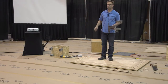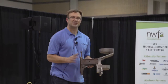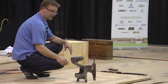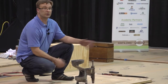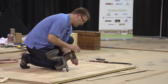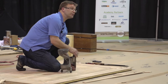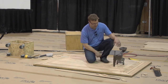The tool they came up with is called a Cavanaugh nailer. This is a marvel of engineering — it doesn't get any more mechanical than this. You feed nails in the top of the hopper. Every time you strike this mallet, it causes a vibration which knocks the nails down into the trough that runs along these guides — it's all gravity fed. Every time you hit this plunger, the nail set at the bottom pokes out just slightly, and that's all you need to countersink it. So you can swing once, drive the nail, and countersink it rather than driving it with a hammer and then going around with a separate nail set.